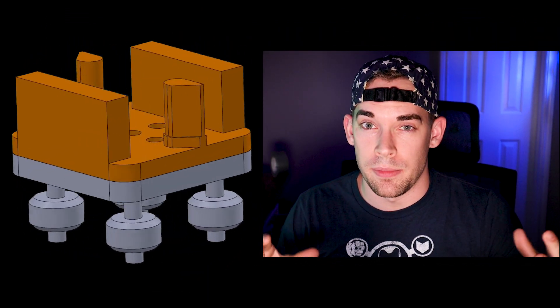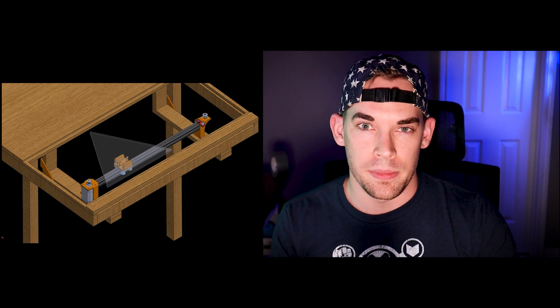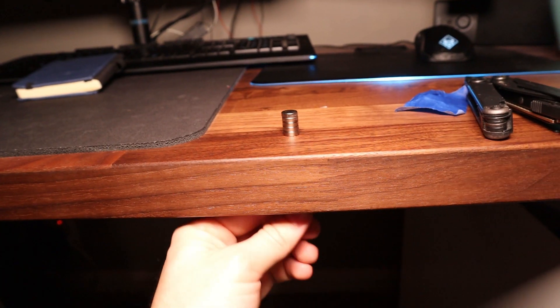You may be wondering how this little thing can fit all ten cups used in beer pong — it can't. So I need to come up with a base that holds the cups without interfering with the rest of the game. I want to use the table as a normal beer pong table without intrusive electronics. I'm going to cut out a triangular piece of acrylic just big enough to stick ten magnets on in the cup orientation, then stick that to the top of the slider. That will slide under the acrylic piece that the cups sit on.